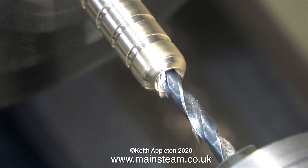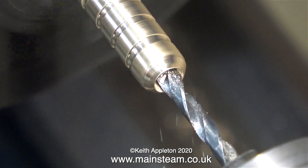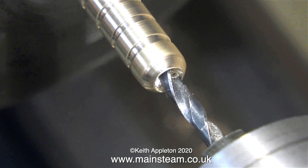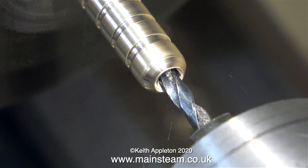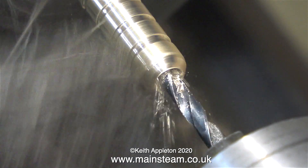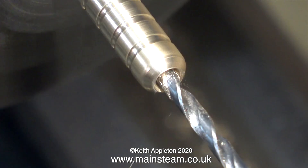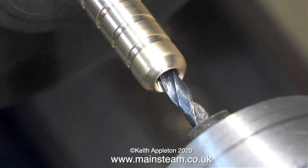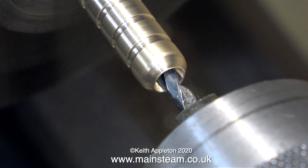The best thing to do is make sure the gas canister cannot be knocked over. At the moment I'm drilling a hole down the center of this piece of brass, and the deeper the drill bit goes, the more frequently I need to withdraw it and brush off all the swarf before starting again. When drilling any kind of metal, if the drill starts to make a funny noise it's probably a good idea to withdraw it and clear the drill flutes of any swarf.